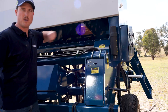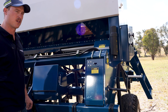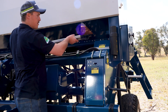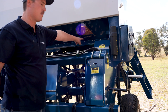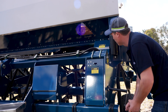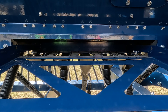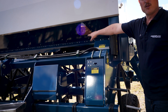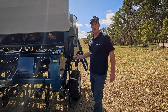Now that we've filled our wheat above the calibration tray, an important step when calibrating our machine is to prime the rollers. What we do is remove the stainless steel calibration tray and wind the crank handle until we see seed falling down into the seed cups. Now that we can see seed falling into the seed cups, the rollers are primed and we can begin to calibrate our agro drill.